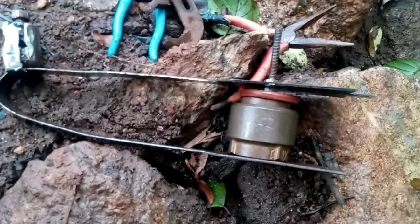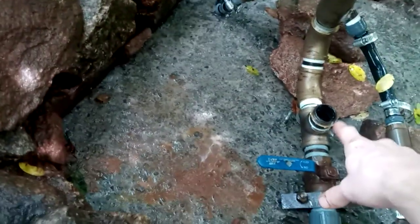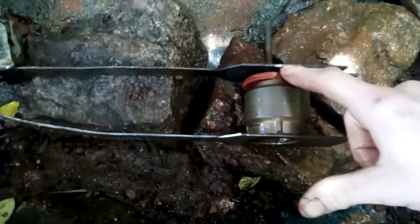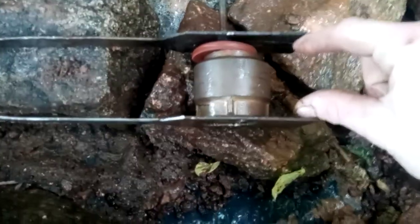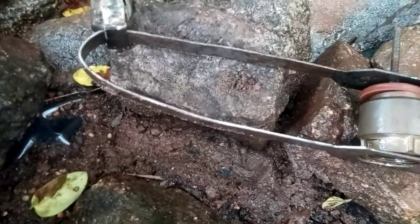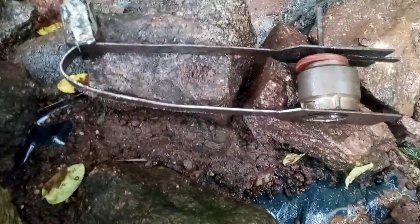You get more water waste and a bigger water hammer effect. I've got a hole at the bottom so that the threads on the pump fit through it, and this right here fits on top of those threads and tightens down — so this thing is really secure. This thing is fully adjustable: you can adjust the stroke here, and you can adjust the weight put on your valve. A lot of times they have a spring here with a bolt sticking through it to adjust the spring tension. I messed with it and watched it run, and I've got the spring into a place where I like it — it's already pushing down slightly on the valve to help it cycle.